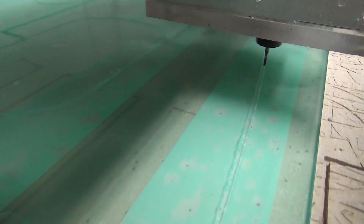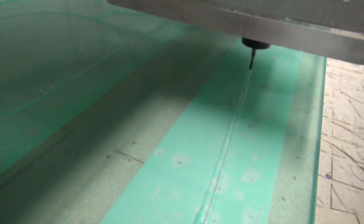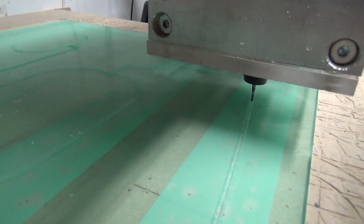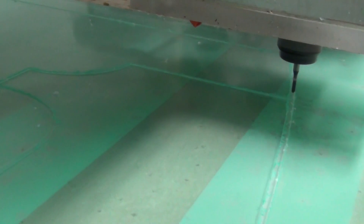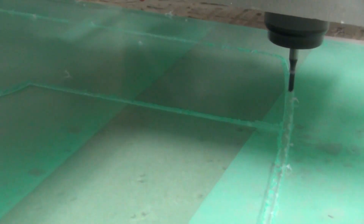The reason for this shallow engraving is just to scratch up the material. This panel will be edge lit, as we say. LEDs will shine their light into the edge of the material, traveling through the glass-like structure until it bounces up to the engraved lines. This results in a glass-like panel with only the engraving emitting the colored light.